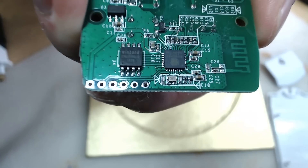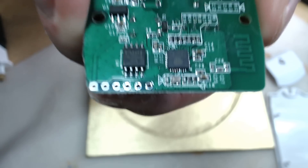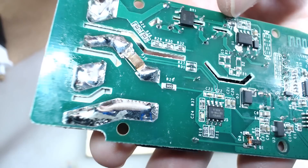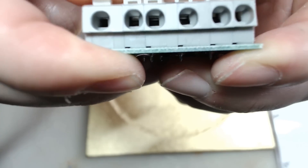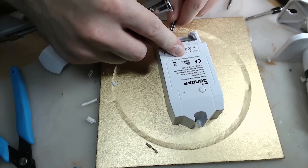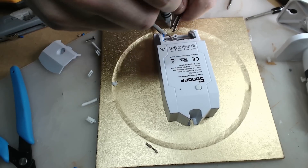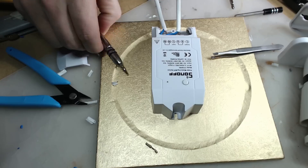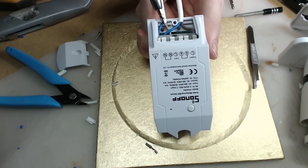The back side of the PCB exposes the ESP8266 — this is the antenna, this is the 8266EX. On the main side you'll see the separated traces for the mains and also some physical separation, which is nice. The button is also GPIO0 for flashing, which is very convenient. There are spring-loaded terminals and you have to push the cables quite deep. This power cable has no earth, so I'm connecting live to live and neutral to neutral on the input.